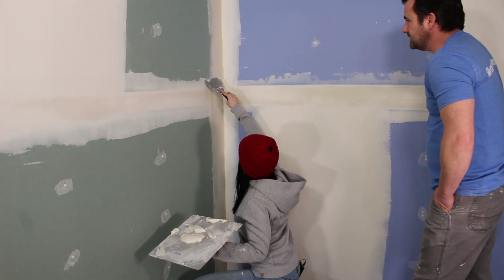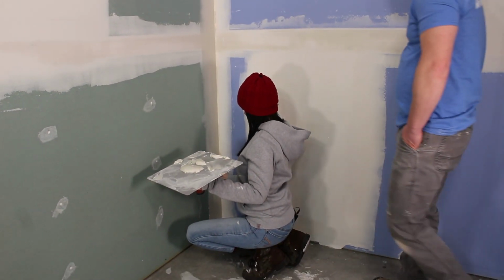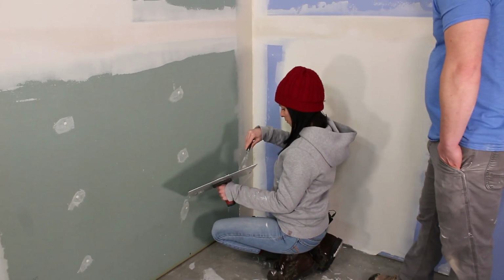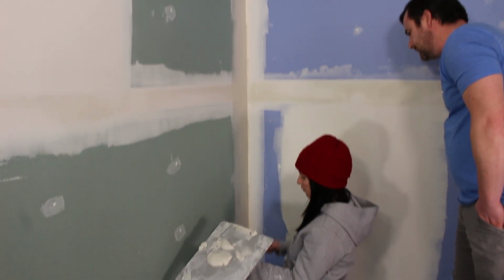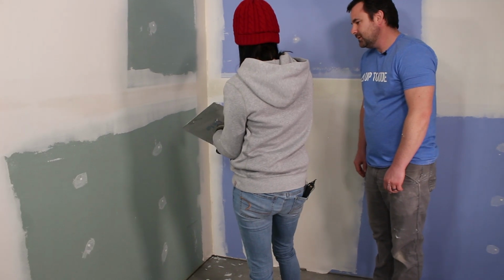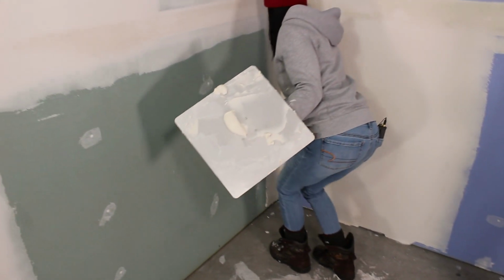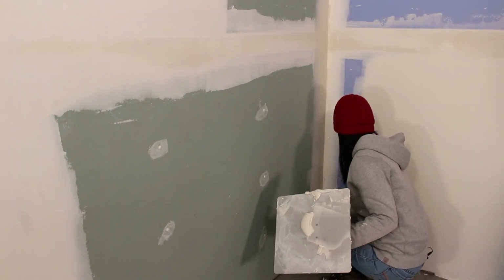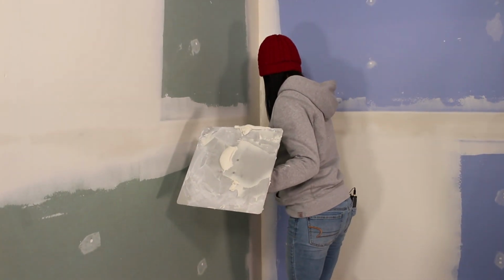Don't cut too hard through your flap, just go real light. Nice. Okay. I'd load a little more mud down at the bottom, and then you can pretty much finish the whole thing. Get it nice and even on your whole knife. Just get a nice even swath. There you go. And just do one right from the bottom up. Wipe a little tighter and move that stuff from the bottom up. There you go. Okay.